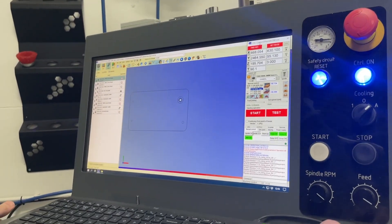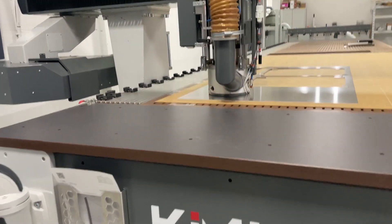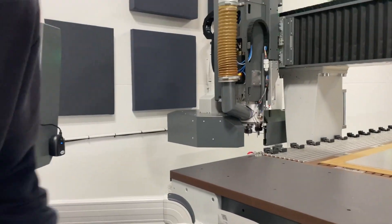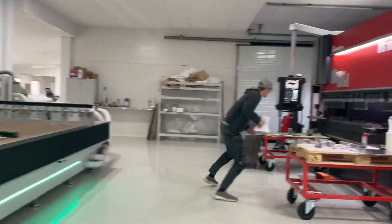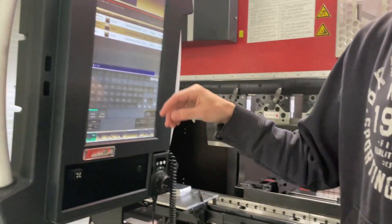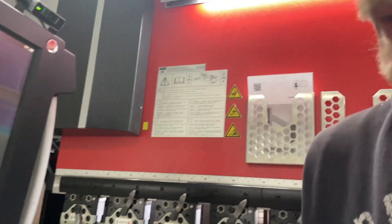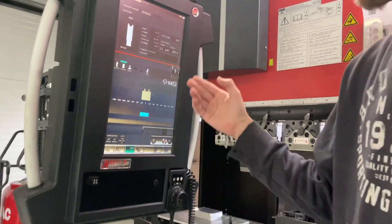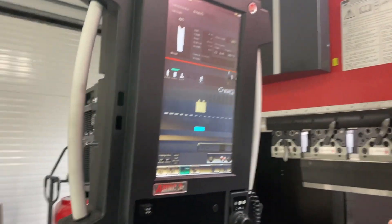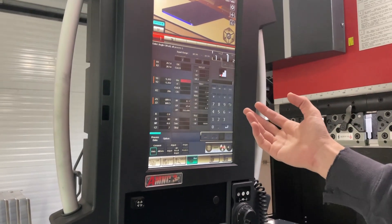We need a piece of material. We're gonna start our vacuum zone. While that's finishing up, let's load this. We're not gonna save the old — we're gonna scan it. We have three files with the same name; it was stupid of me to name it '123'. Anyway, it's loading the bending program. It's recommending — it always recommends this if the parts are smaller than 400 millimeters in width. Minus 3 degrees — that's typically what it is for 3mm material.